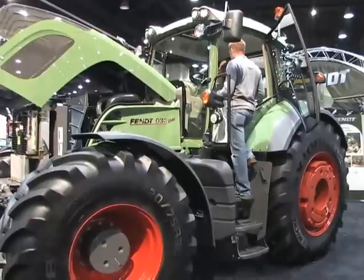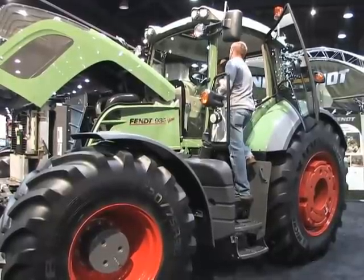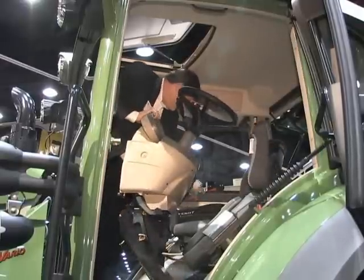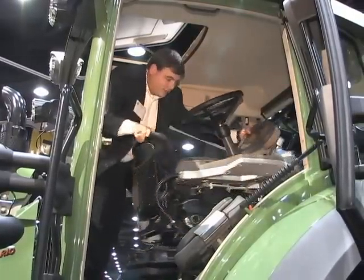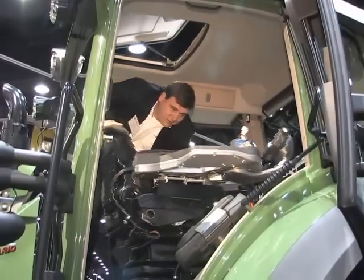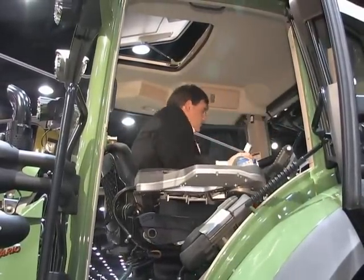What's really unique about this tractor is the fact that it has a reverse operator station, or reverse station as we call it. With that, the entire operator station and all the functions reverse 180 degrees — the pedals, the steering wheel, the multifunction joystick and controls. You would use that on snow removal for blowing snow with large industrial areas, or you could use it with a 30-foot mower mowing large swaths.